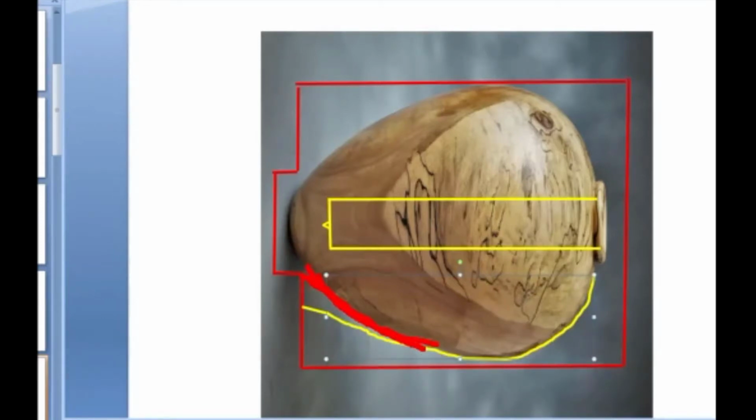And basically it might take me 8 or 9 tries of different contours before I'm happy with the contour. At that point then, it's still thick. Looks like something maybe like this. I'll reach this level, but it'll still be thick like this. At that point, I'll return to hollowing, and then I will start back up here, and I will get the final wall thickness all the way down. And then here again, the wood is relatively thick at this point. I'll gradually remove this stuff to get the final thickness. Then I'll take it out of the rig, reverse the piece, and finish the bottom. So that's how I'm going to show working today.